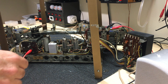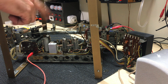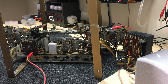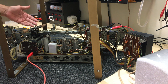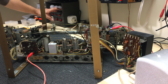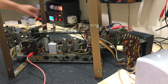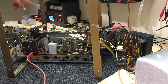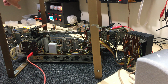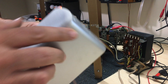I've put in an antenna from the mini whip, connected it to the antenna socket of the AM. I've got the tubes in. I've got the volume high. I've got it on shortwave — yeah, I think that's shortwave. Let's hit it. This should glow a lot brighter this time, hopefully it doesn't stay on. It's going up — so it's not a short. It's drawing 110 milliamps. The radio's seeing 184 volts. That lamp is glowing dimly which means it's drawing current. I can see the heaters on the tubes are on. And I don't hear anything yet, but give it some time.